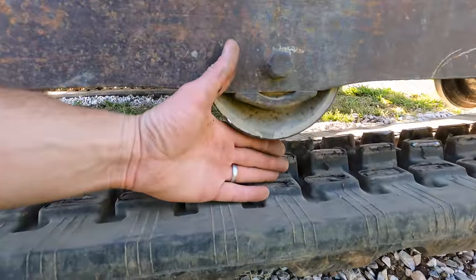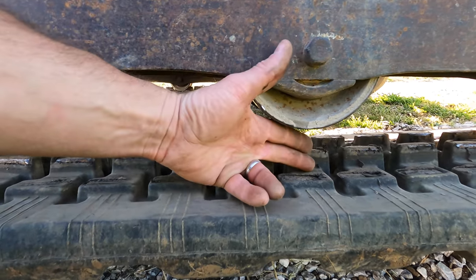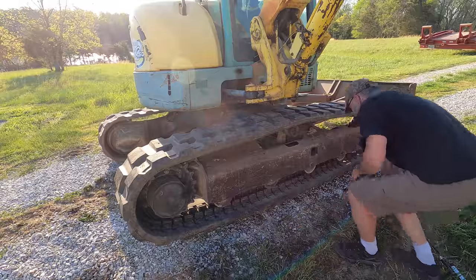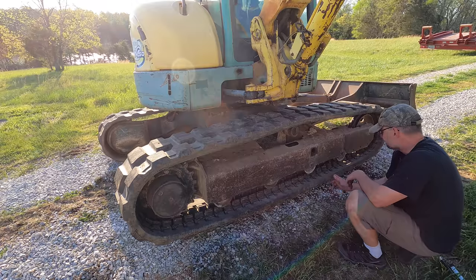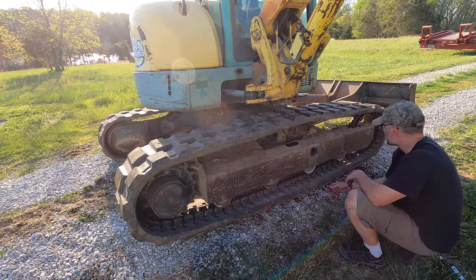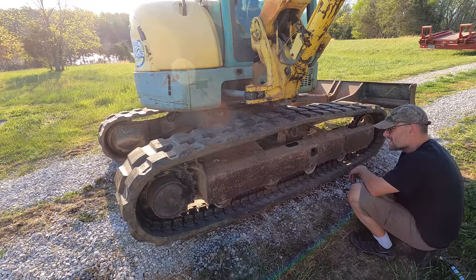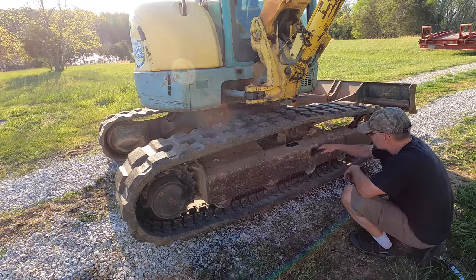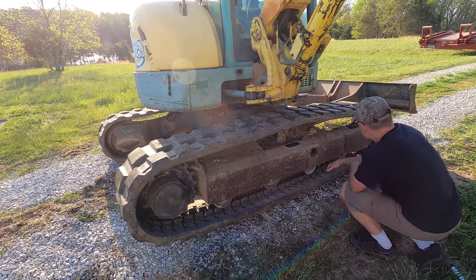Look at how much slack there is there. That's a good 2 inches. It's supposed to be about half an inch according to the service manual. So I greased this side only to find that it is as tight as it will go. It won't get any tighter. I think there's something wrong with the grease adjuster on this side. You know, it's working. It's not throwing the track or anything. I'm gonna have to think on that. I'm not sure what I'm gonna do. Some of you experienced excavator guys, comment below. Tell me what you think that I should do or what you would do. Besides clean out all that grease.